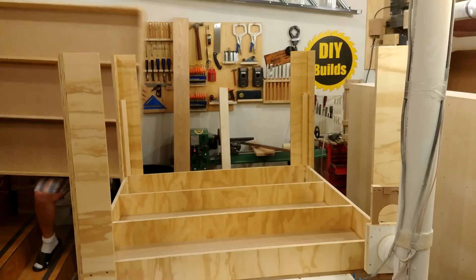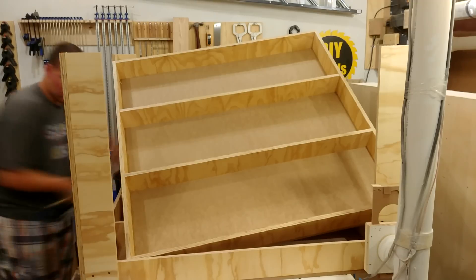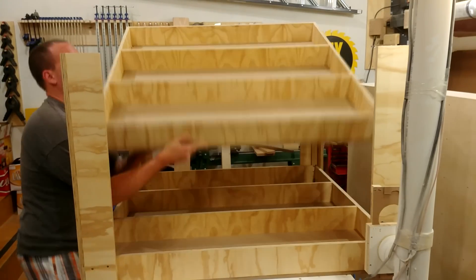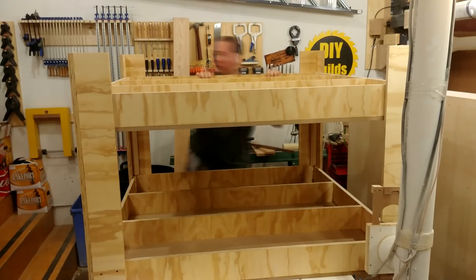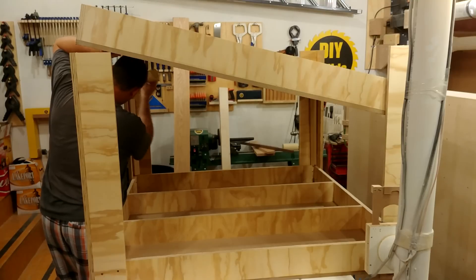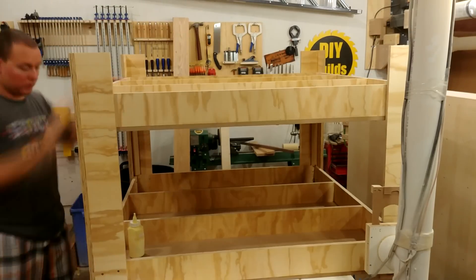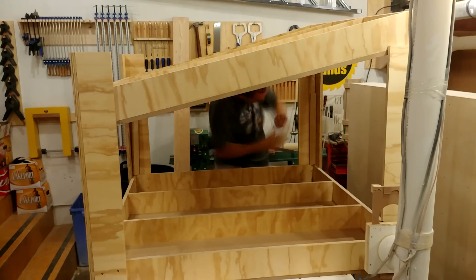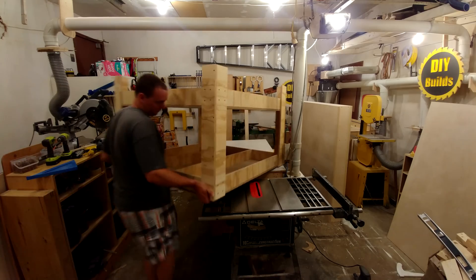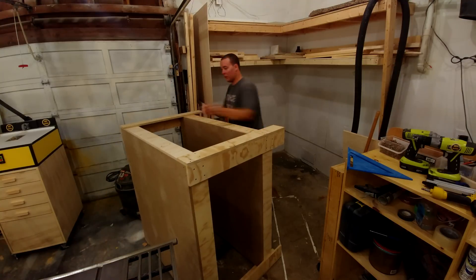I cut some scrap wood spacers in order to put down the bottom shelf at the exact height that I wanted it. Getting the shelf up here was very tricky by myself and a bunch of the spacers started falling down, so I drove in some brad nails to keep them in place. Once the bottom shelf was sitting on all the spacers, I lifted up one side at a time, applied glue to where the thickness of that shelf was going to be, and then dropped it down again. I then drove in four two-inch screws on each side of each leg. That's it for building the table that the CNC sits on. I just had to move it off the assembly table without killing myself and get it into the corner. The corner turned out to be very uneven, so I later shimmed three of the legs.